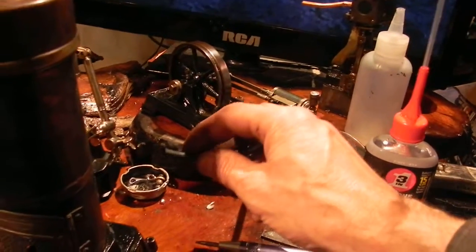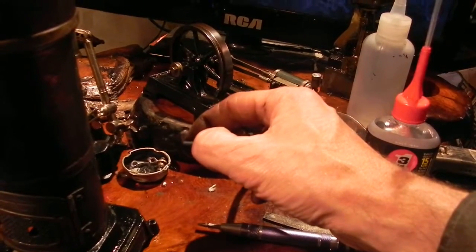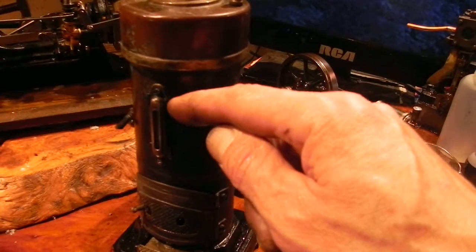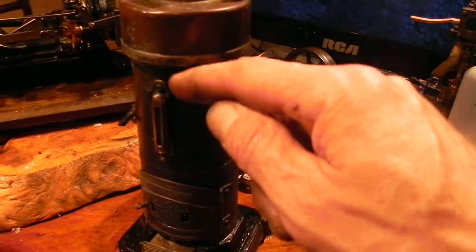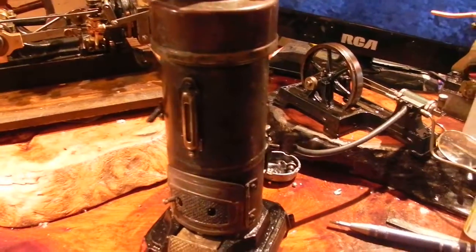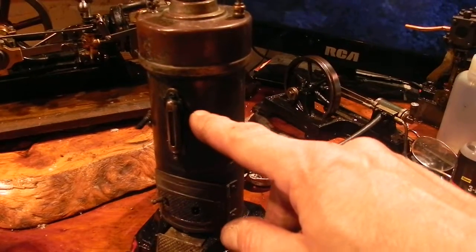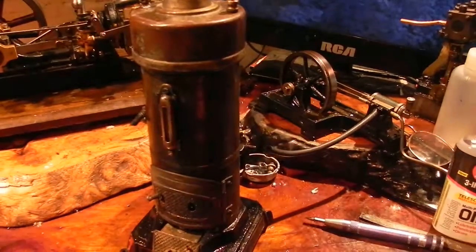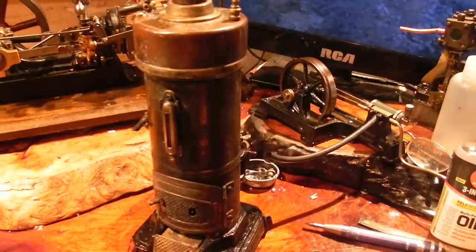I had to replace the sight glass bushings, and what I use is this silicone tubing. I get black silicone tubing, but you can get mostly any color. Slicing thin washers of this silicone tubing, because it's so heat resistant, you're able to put washers on your glass tubes from 3mm to 6mm and use that as your sealing washer. I just had a blowout on this — it was getting quite high in pressure. It blew out the top because it had the old rubber black gasket against the metal plate, and it blew out quite a bit of steam — quite a catastrophic failure of the seal. Now I've got it fixed.